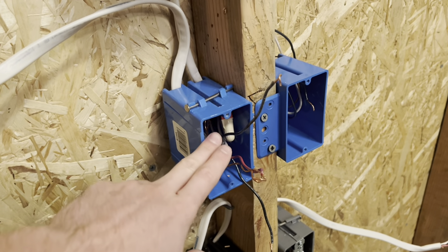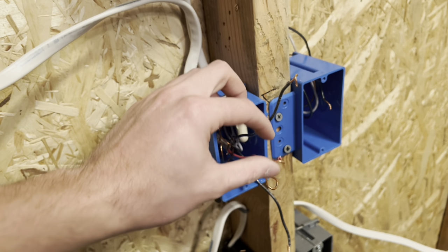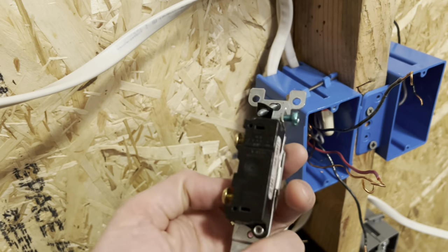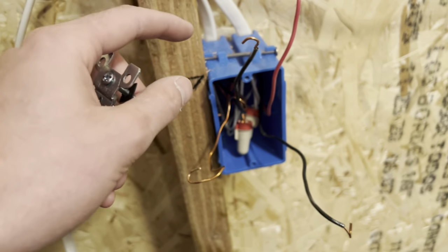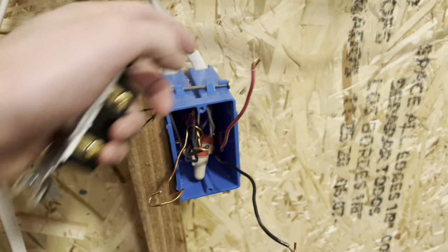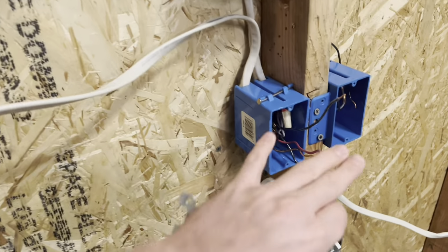On the other side where you're putting your switch, don't touch any of the neutrals or grounds — you're going to reuse your ground pigtail. Cap off the black traveler, and then use your two new wires: your switch leg and your red wire for the new switch, along with your ground. If doing it on the other side, same thing — leave your ground pigtail, keep your power wire, use the red wire again, cap off the black wire, and on the other side cap off the black traveler and tie the switch leg and red traveler together.